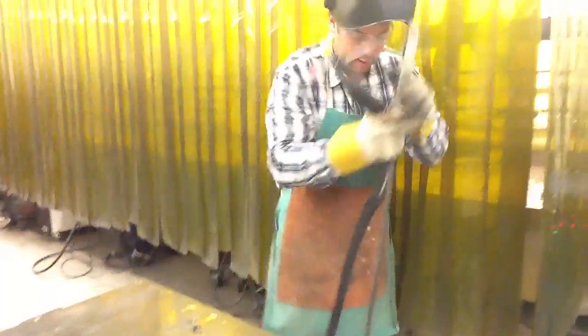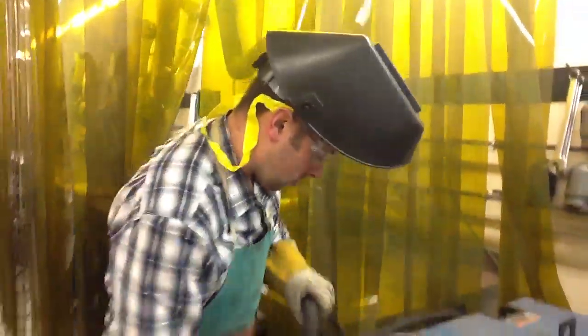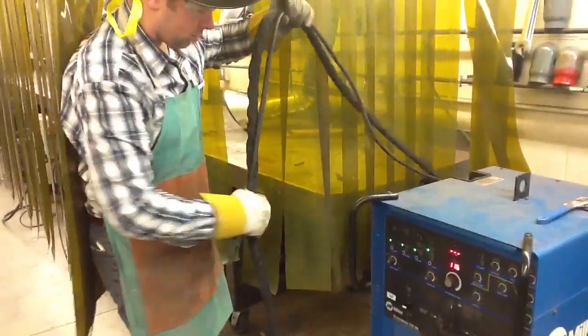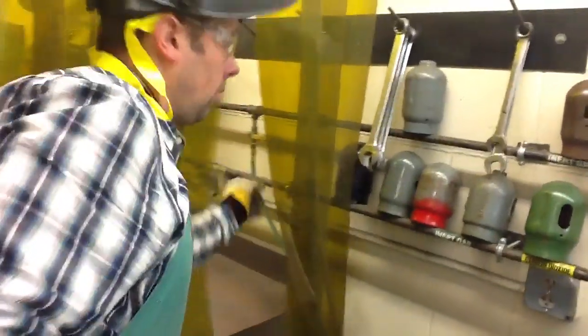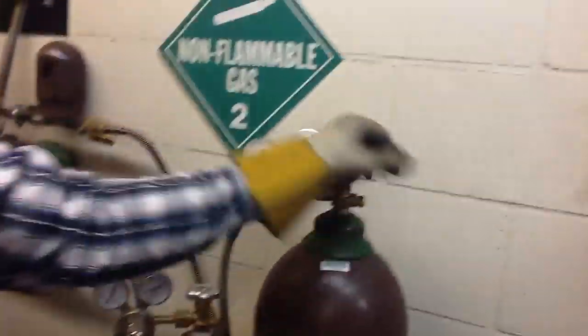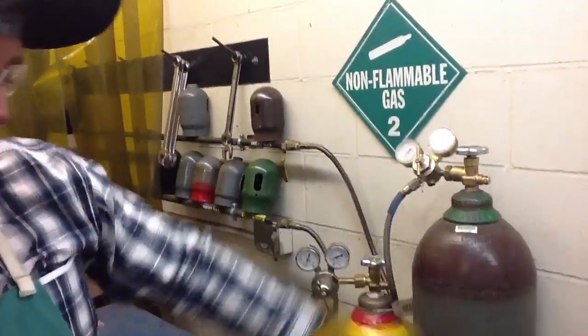When you're done, make sure you wrap up the cords on the welder so they're not on the ground. I'm going to loop them so they're not on the ground because I respect the cords. Be careful — don't drop the torch, it's a ceramic tip and it'll break. Loop up one more time and then lay this torch head right over the top here. I can shut this machine down. I can shut my gas off here. And if I'm done for the day, I can shut it off at the tank as well — that means we're not going to lose a tank of argon overnight because of a leak.